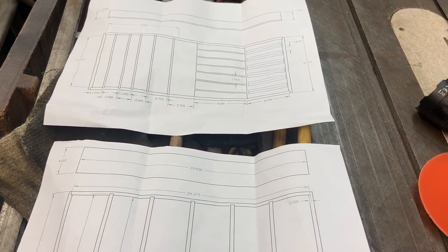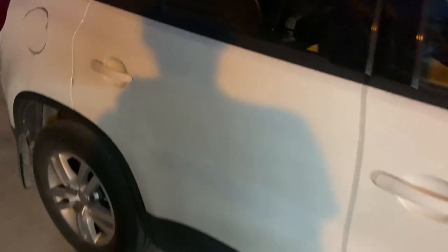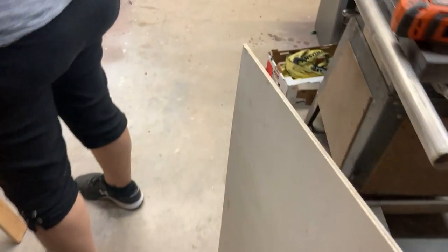I also bought a piece of what's called underlayment. If you look at it, this is like the bad side — it's just got these tiny little hardly-anything marks. And this would be the good side: beautiful, smooth as can be. Nice stuff. It's called underlayment, but it's great stuff. Here's the reason why I buy it: if you look at the plies, this is three plies thick and it's quarter inch thick overall, so that's a lot of thickness per ply. That lets you sand this thing when you build with it, and there's enough wood in each ply to actually sand.